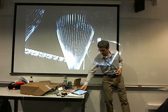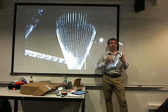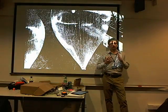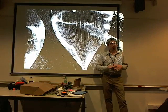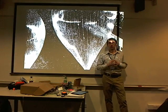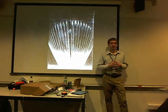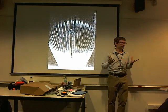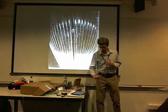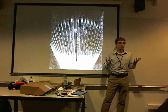One of the real persistent problems plaguing balloons at all stages of pressurization is that Mylar is very sensitive to folding and kinking. If you fold it once and then intersect that fold with a second fold, it's almost guaranteed to create a hole where those intersect — a very tiny pinhole where the two folds meet. That happens through everyday handling, folding, and shipping. Any fold or wrinkle you put in Mylar is essentially permanent. This is a problem when you have to ship from Texas to New Zealand and launch in gusty winds.